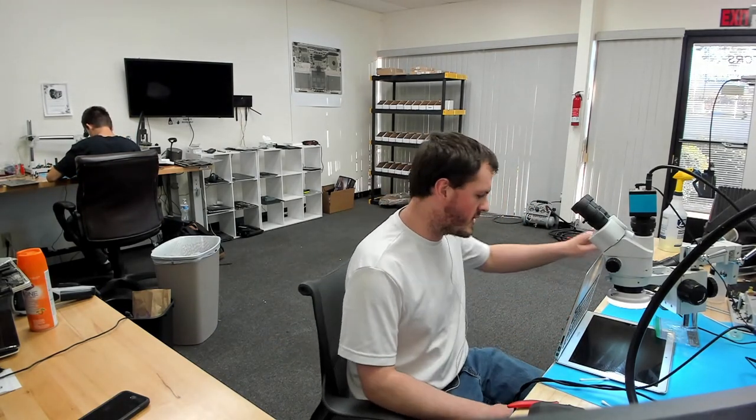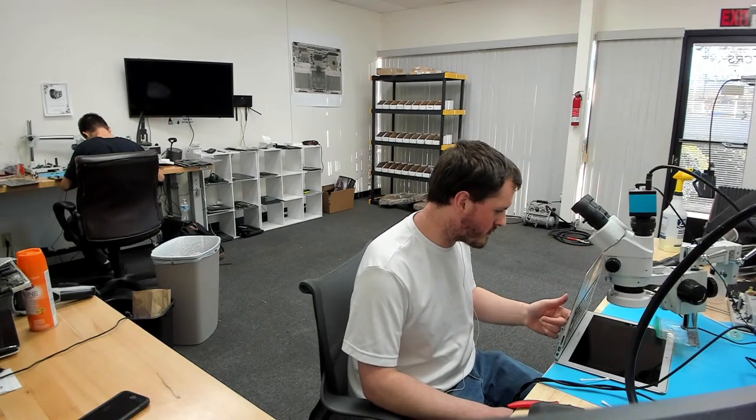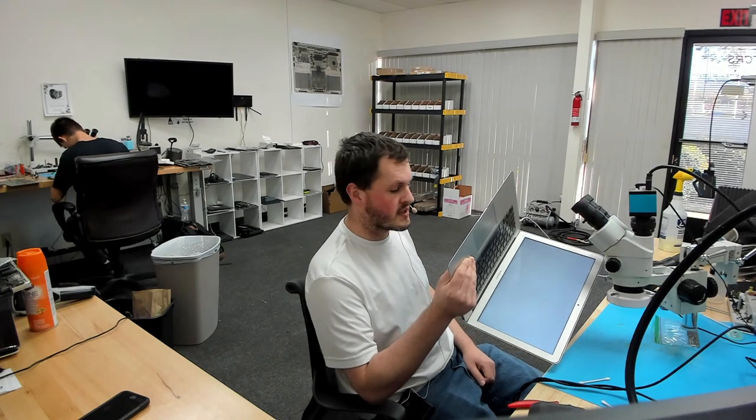So I have our charger plugged in, we have a spinning fan, and hopefully I get backlight and a flashing question mark folder. That is a beautiful backlight. Look at that. Let's wait for it to give us image. Come on, flashing question mark. The reason why I say flashing question mark is because this machine does not have an SSD installed in it at the moment. Come on.